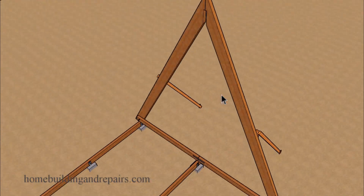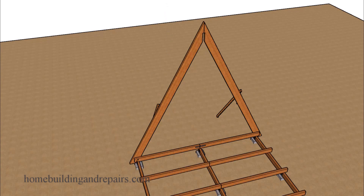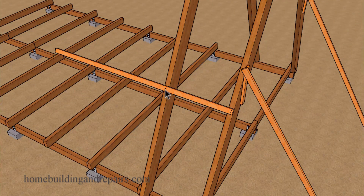What I would do in a situation like this is assemble one section to create a pattern I'm going to repeat for the rest of the building. This lets me double check that the beams are going to be the correct length where the block will meet the corner. After we have the first section braced off, we can install the next section. To stabilize everything, we simply use a scrap of lumber — a long 1x4 or 2x4 — and you can put one on both sides if needed.